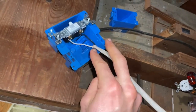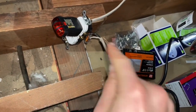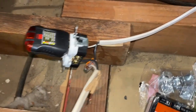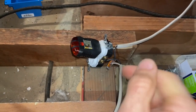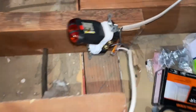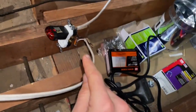That wire right there should also be black, but basically it's really as simple as taking the black wire that would have otherwise gone into that power outlet and connecting it to one of the two black wires in your switch wire, then going to your switch and then back from the switch all the way back to the power outlet.